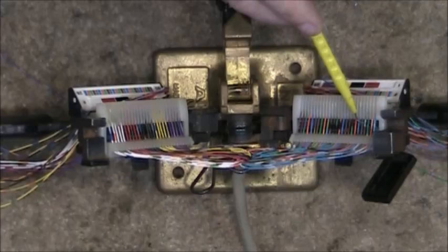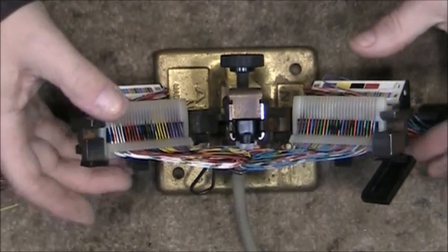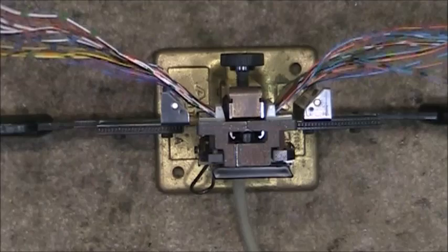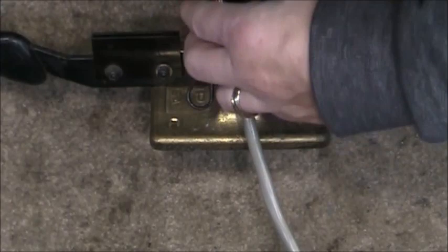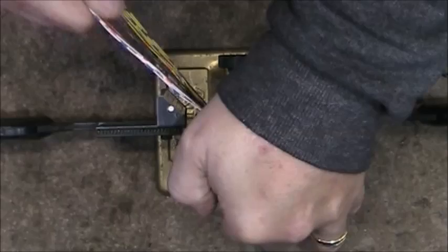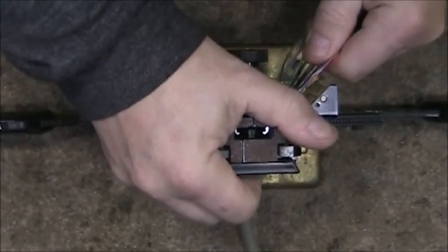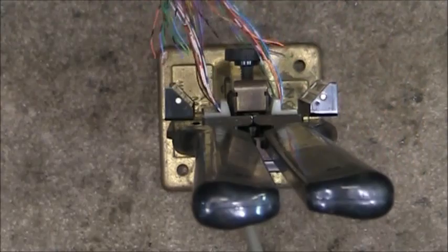On the ring side we have the five pairs, and I've done this enough to know they're in order. With that said, I'll flip up the part that holds the Amphenol and close both the left and right sides of the Amphenol. The wires are a bit puffed out, so I carefully push them in without pulling them out of the comb, then pull out the slack. When you're done you should have almost no slack left — that's important when you go to put the hood on. Then close the handles and crimp both sides.